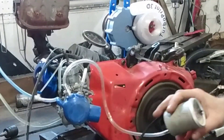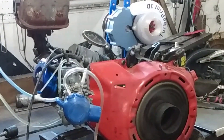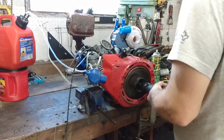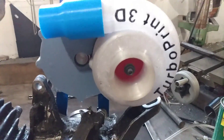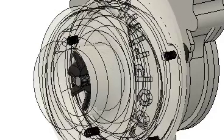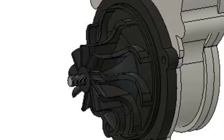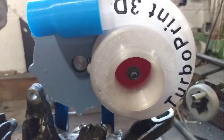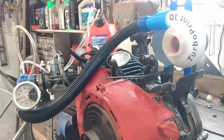Before I hit the 15-minute mark, the turbine seized and kind of shut itself down. After disassembling everything, with another quick redesign I assumed I'd fixed the problem. Turns out the nut I was using to hold the impeller onto the shaft — once everything gets a little warm and under vibration — was pushing into the shaft and mating the back part of the impeller to the backing plate. To solve this, I machined a small groove in the back and put a washer back there.